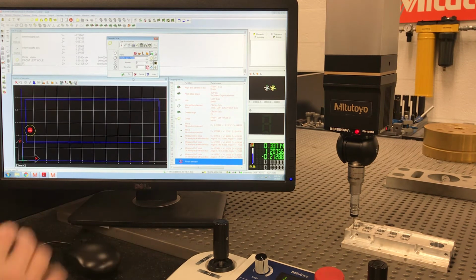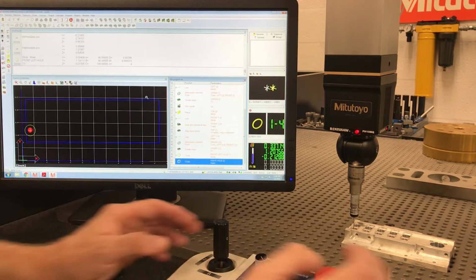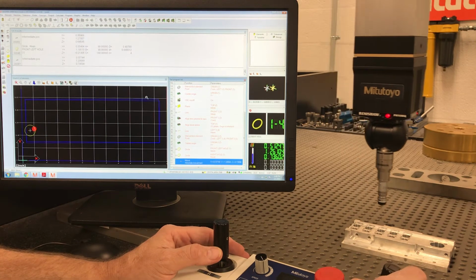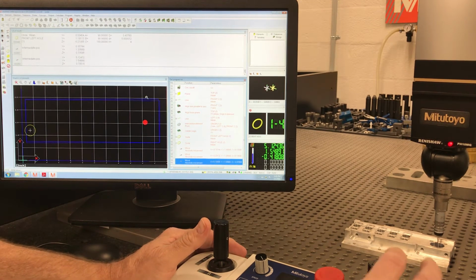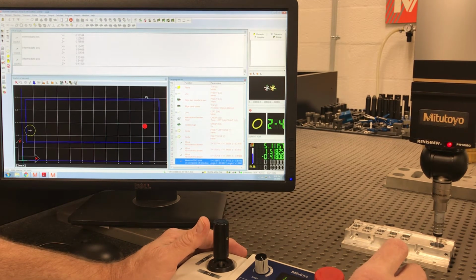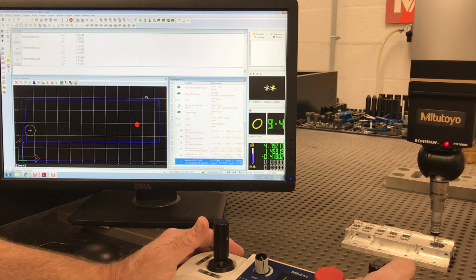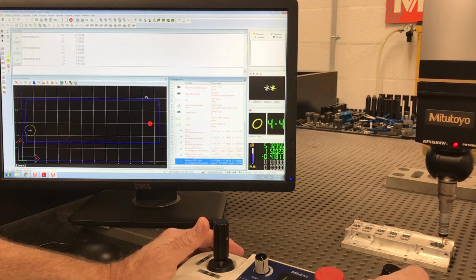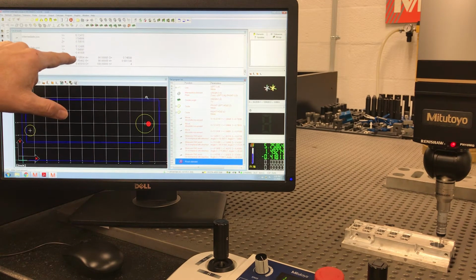Let's call this one right hole. Okay, come up out of it, go to about the middle, go to, drop down in there. You can actually hit a go to here, will not hurt. Force of habit for me, I tend to go north, south, east, and west when I'm measuring. That's just a personal preference. All right, the hole is 745 thousandths 3/10. It's sitting at 5.105 in the X, 1.504 in the Y.